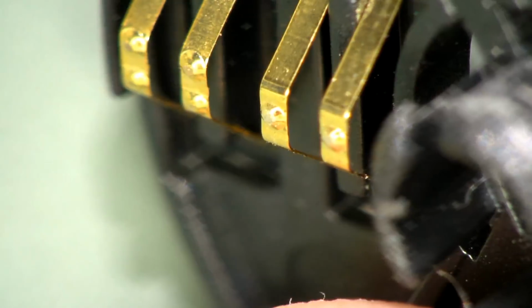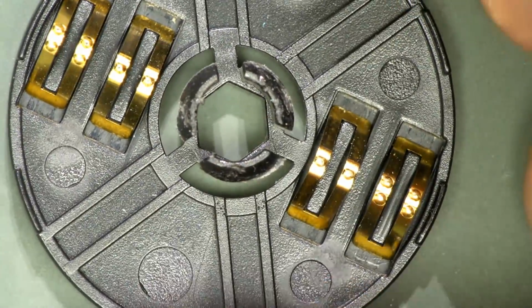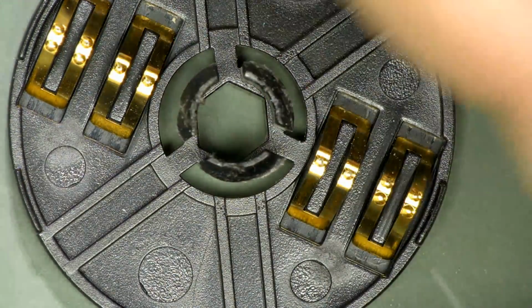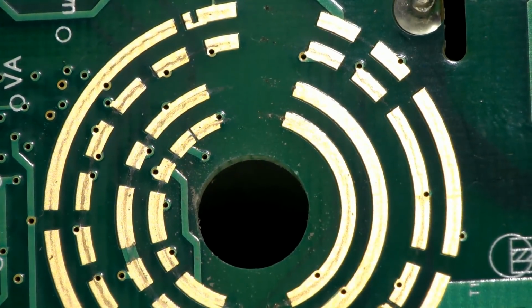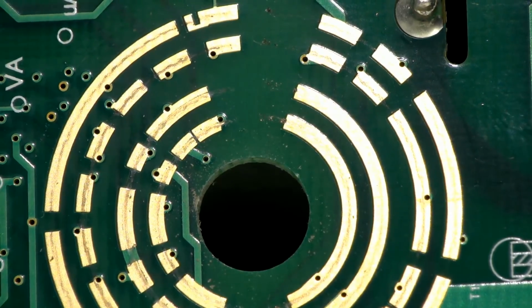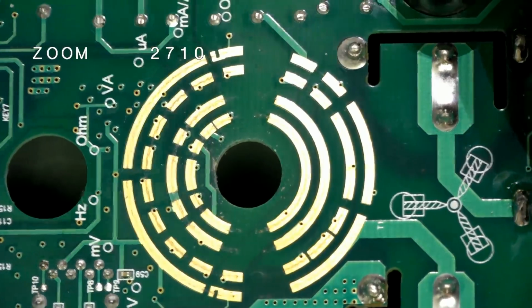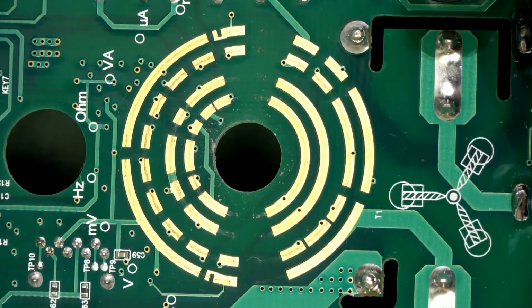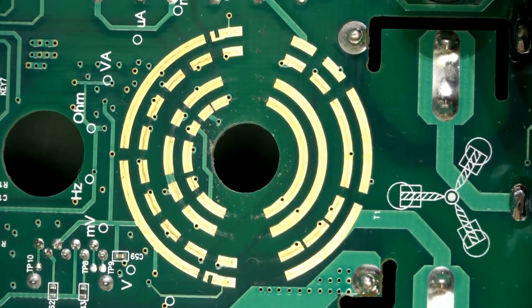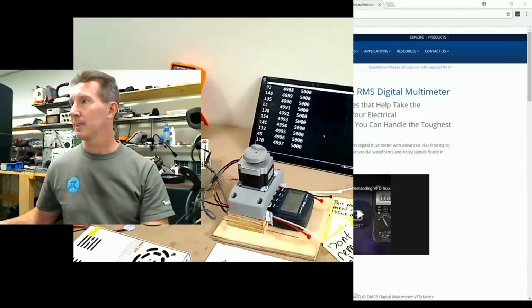There we go. Maybe some plating is starting to wear off the contacts, I don't know, but they're still looking really good. So that combined with the board, it's not too bad. On the real tester, we'll whack it in and do 10,000 cycles next and see what happens. But there's nothing seriously bad there at all. The contact resistance is still good. We haven't run the numbers yet, but I think it's always under 1 ohm or something. So that's fine.